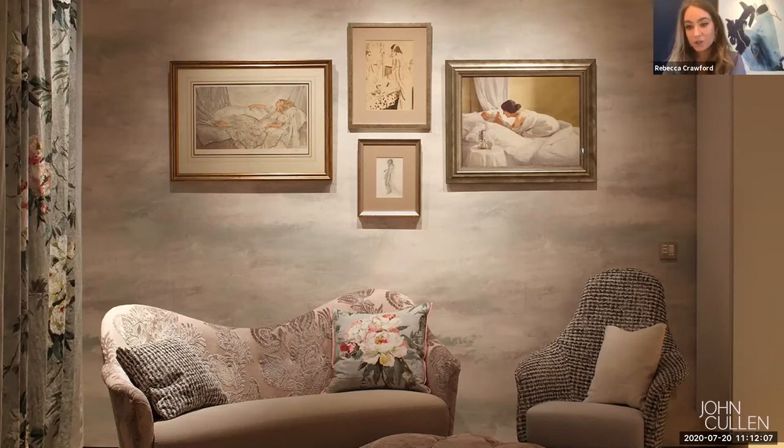You also need to consider how exactly that light is angled towards the wall. If there's too harsh an angle from the ceiling to the artwork, you'll get a very tight beam of light that will cause glare in your eye. This is particularly tricky with framed artwork that has a perspex front. If the light is too close to the wall based on ceiling height, it will skim at a very narrow angle and land too much on the floor, reducing the focal point from the wall.